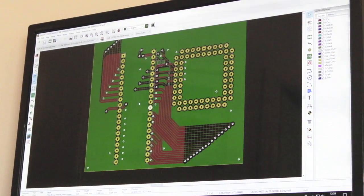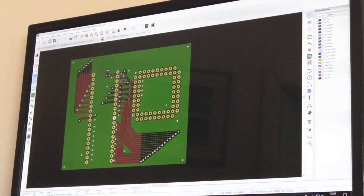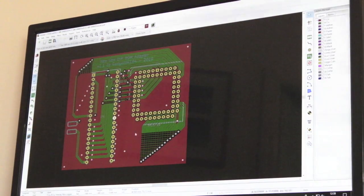There's very little needed to do, and then I could just finally do the stitches, or at least the wires here, on both sides to join the top side to the bottom side on all the ground connections, and that's fine. That approach seemed to work well. The first time I did it, I spent a lot of time messing with the ground plane, sort of midway, and that's just a huge mistake. I would do it as the very final step, because then you get fewer issues.